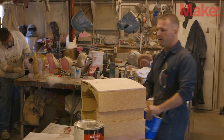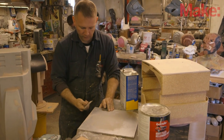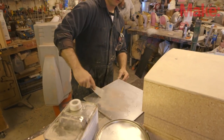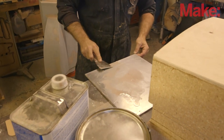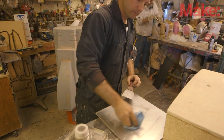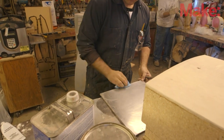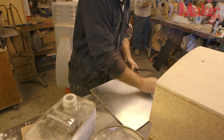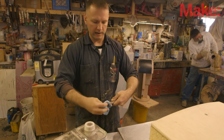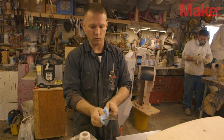You want to clean off your tools as quickly as possible because if you wait, it turns solid and then you basically have to grind it all off or carve it away with a knife. I just splashed a couple ounces of acetone on top and the next step is just scraping everything a little bit so that nothing actually sticks to my mixing plate. Then I finish with a piece of paper towel to wipe all of that off before it cures and becomes solid on the plate. I have an entire wall in my workshop that rolls out of the way so I get fresh air in here. If you're working in a more confined space, the acetone will make you kind of stupid really quick, so you really want to have lots of ventilation when you're working with this, or just wear a respirator.